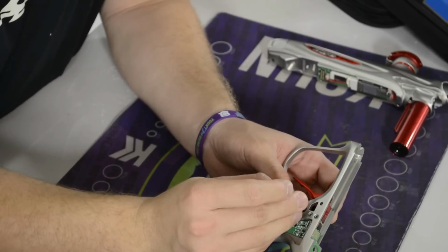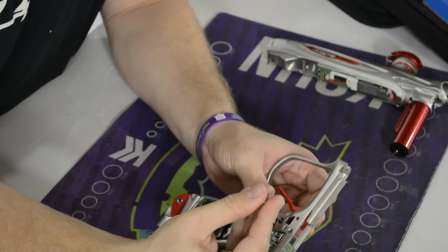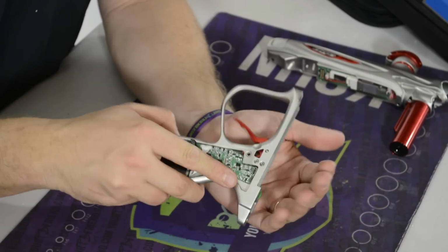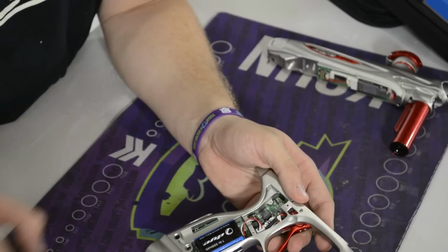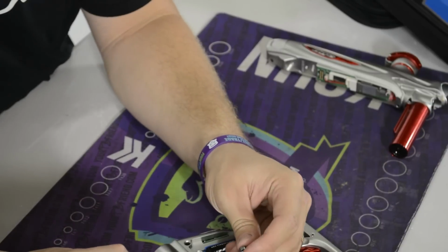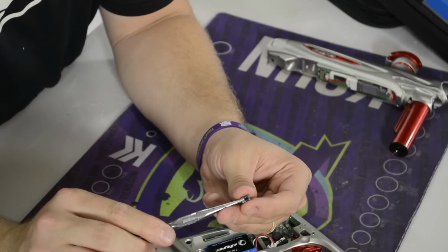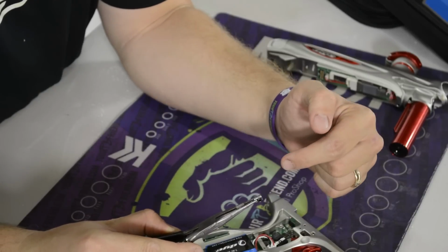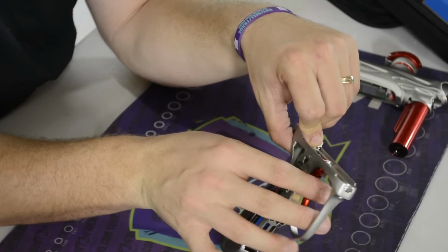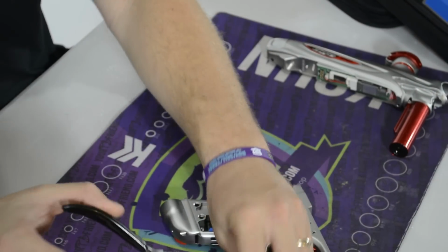And then finally, you have this screw, little black screw on the outside. And what that does, and this pulls out the magnetic return base plate. So if you see, this is the grub screw, and this is what, when it's closer to the magnet, it creates more tension, and when it's farther away, or you can pull it out and you're running the trigger without any tension at all.